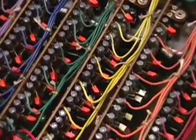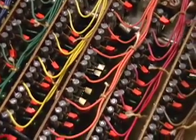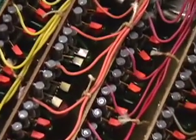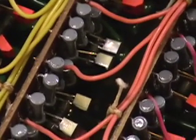We looked at all the resistors on the circuit because this type of resistor, even though it's a 1% resistor, has been known to open up. This is from my experience dealing with repairing instruments such as meters. And then the last thing we looked at was the capacitors.